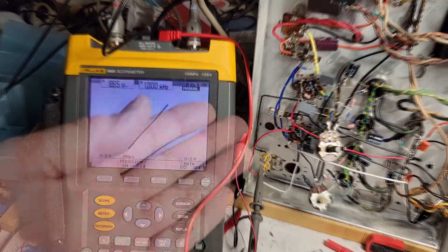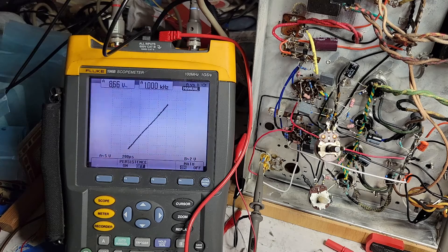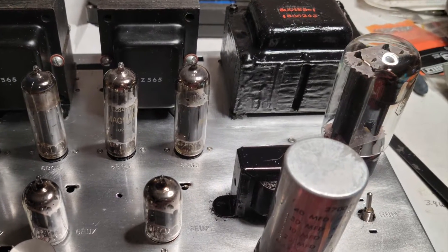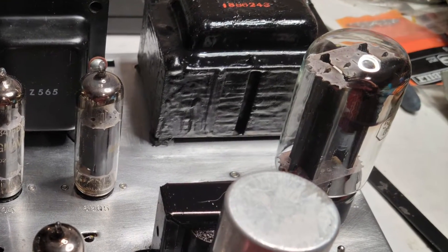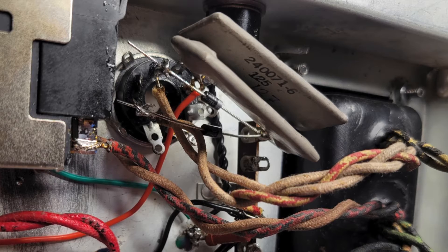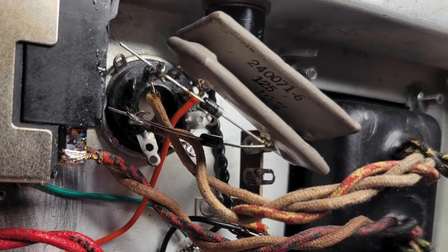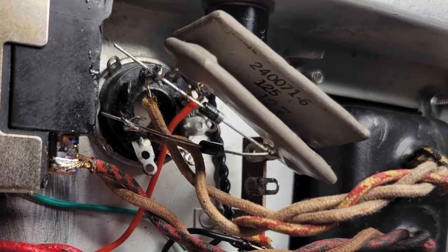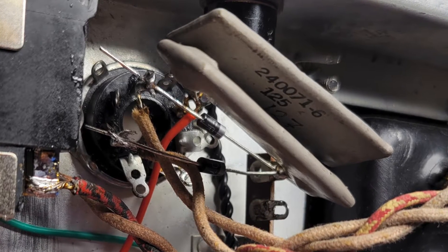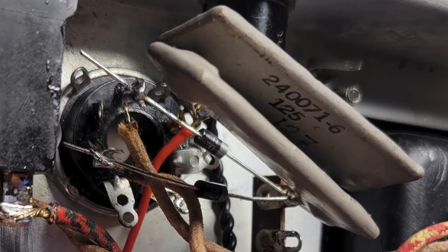In the end, I'll try to figure out what resistance to put on these cathodes such that the amp operates as well as it can with this power transformer. So far I've assumed you're using the best rectifier possible, or that you're stuck with whatever you already have. In this case I was using the 5U4 or 5U4GB tube rectifier. I tried two other options. One, pictured here, was to go with a solid-state rectifier — use a couple of diodes instead of a tube rectifier. I needed to add a dropping resistor: two 125-ohm resistors in parallel for 60 ohms, to drop it to the 320V or so I needed for my B+. With that solid-state rectification, I was able to use the design values for the cathode resistors — I had the voltage I needed and the power I needed.